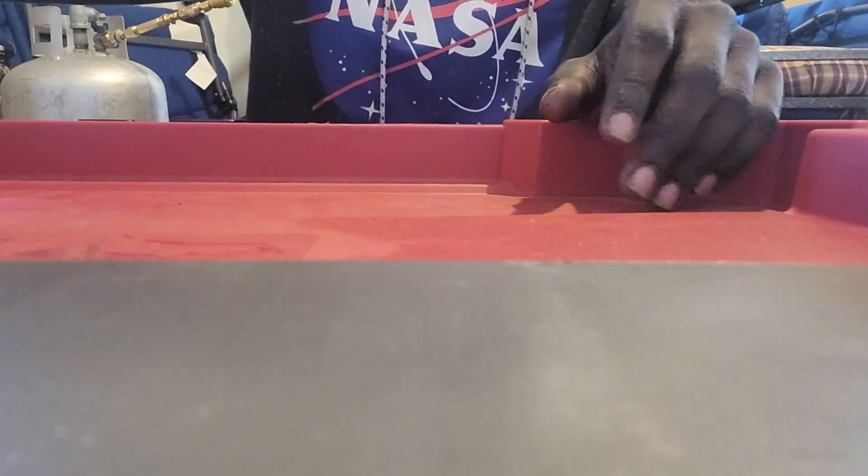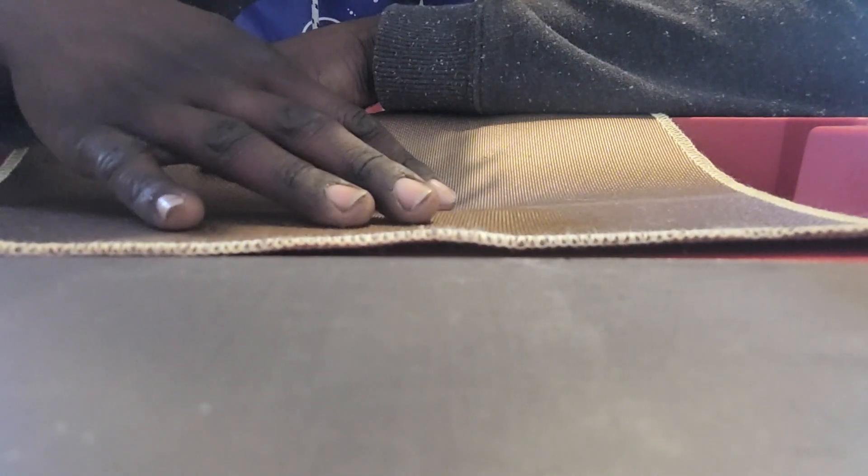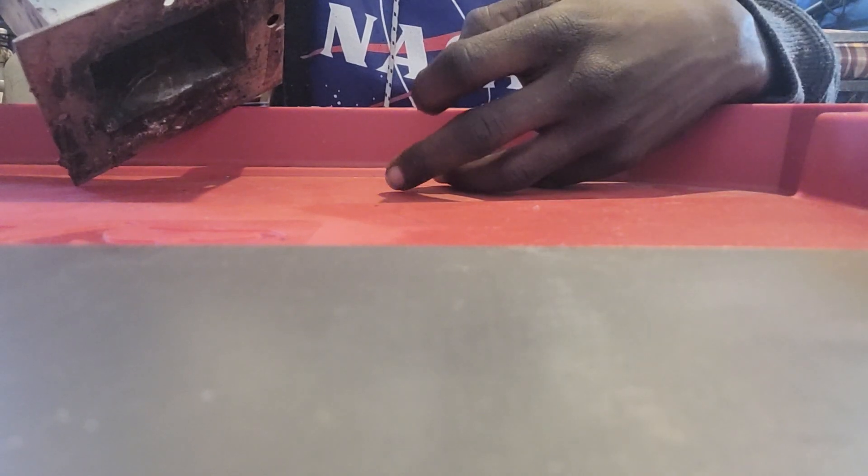So listen, I got an idea. As we know, the material I've been using to seal the waveguide is this type of stuff right here. This is fiberglass and vermiculite — pretty much a complete inorganic matrix, woven together. It's been pretty good at sealing the waveguide pretty airtight. This is the waveguide for reference. Microwaves need to come out of here. No gases can go in, and nothing from the atmosphere can go in either. So it pretty much needs to be a complete seal at the front, but there needs to be a material that microwaves can pass through without interference, and also it needs to block anything coming in or out. These types of materials do that.